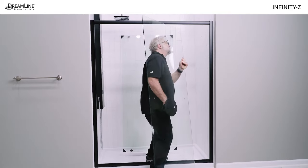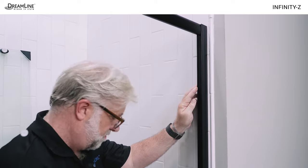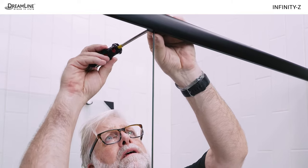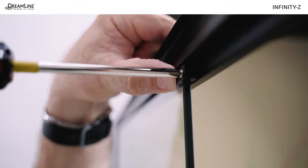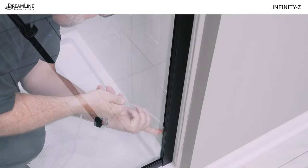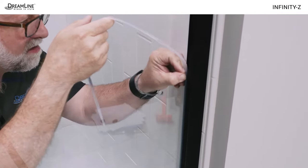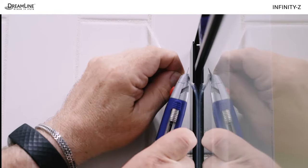Apply a small bead of silicone on the ledge of the bottom rail where the stationary panel glass will go. Install the panel glass, carefully sliding and inserting it into the side slot in the glass profile. Install the glass clips in the pre-drilled holes on the top and bottom rails with a Phillips screwdriver to hold the panel glass in place. Snap in the narrow edge of the V-shaped glazing vinyl between the back of the panel glass and the profile, starting from the bottom and working upward. Press it in firmly once in place and trim any excess.